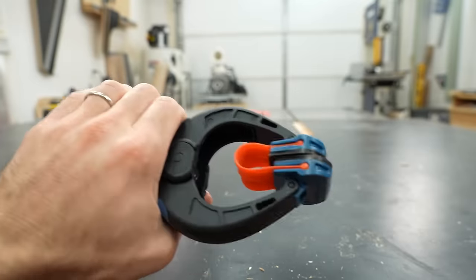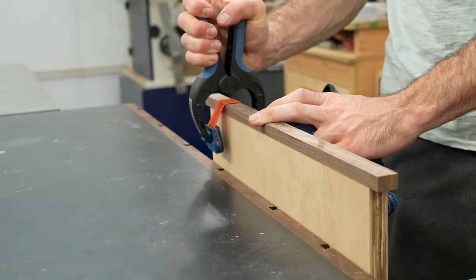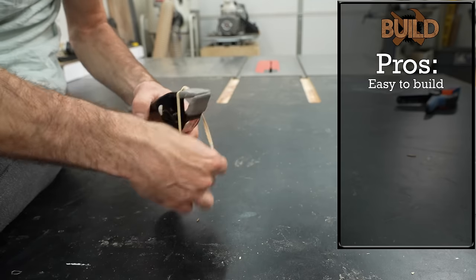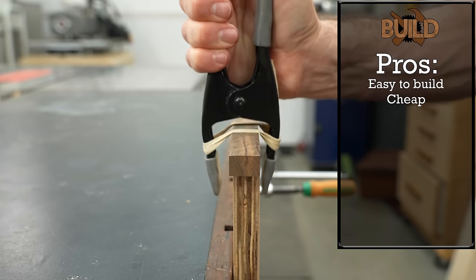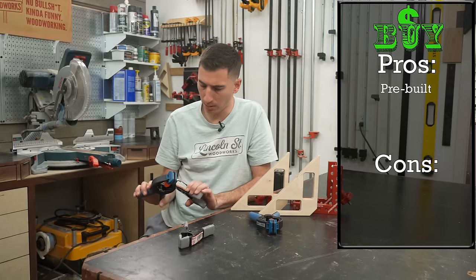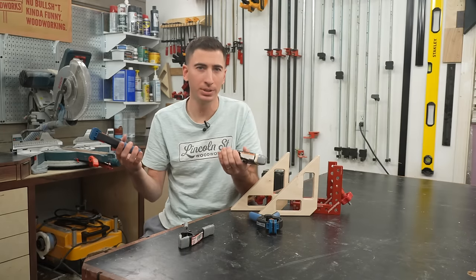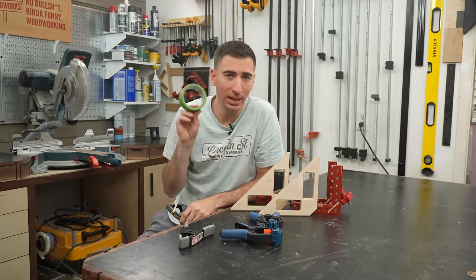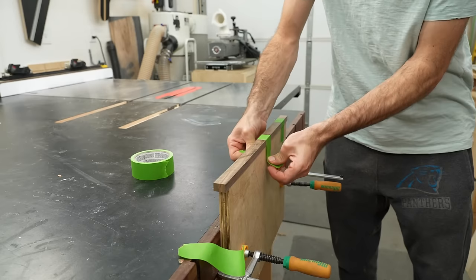These fun little guys are known as band or edge spring clamps and they have tons of applications, but they're mostly used for holding down edge banding or keeping face frames in place while glue dries. You can build your own by putting a heavy-duty elastic on a spring clamp — about five bucks for five at Harbor Freight. But compared to buying the specialty version at $5 to $9 a piece, you should actually just pass on both. You can do the exact same thing with painter's tape and you have unlimited clamps. If you need it, good tape provides more than enough pressure — and if you're having difficulty, whatever you cut is likely not flat or straight, and you have bigger issues.